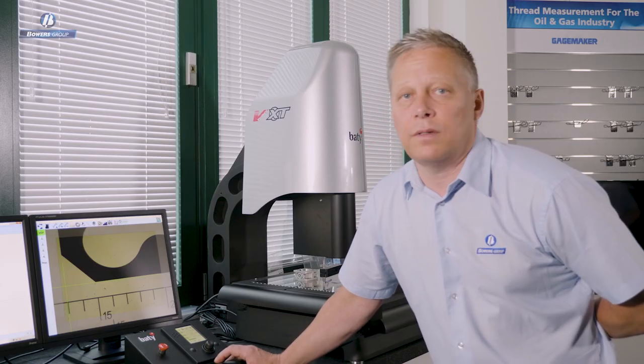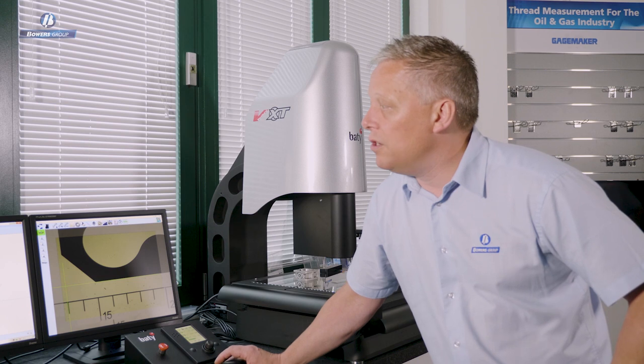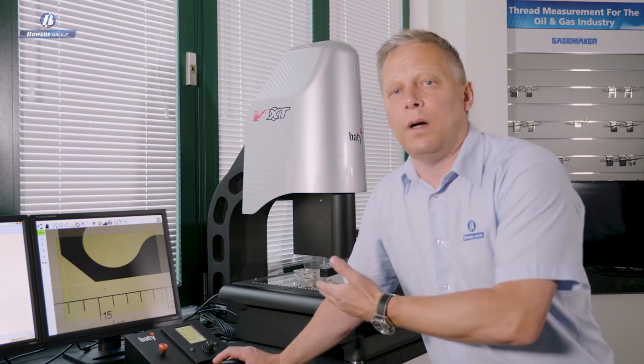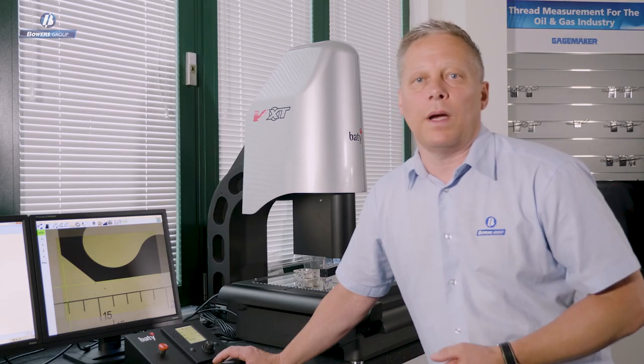Many people like this style of reporting because, as engineers, we're all used to reading engineering drawings. I'm arranging this view just like the manufacturing drawing I'm using to control this part. For example, selecting two radii, the software previews the dimension type it will give me. If that matches how the drawing calls it out, I just position the dimension. If not, right-clicking allows me to change the dimension type to replicate the drawing. Setting up results in a familiar way is incredibly easy.